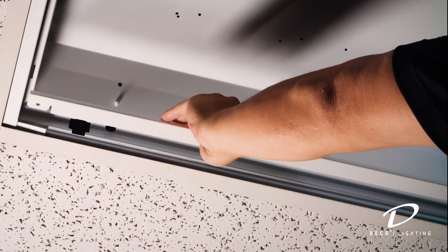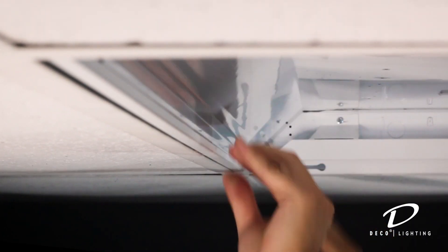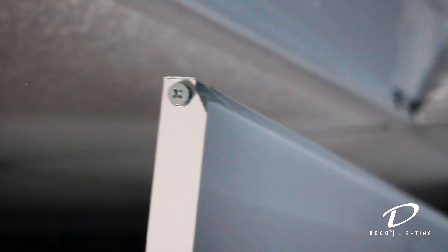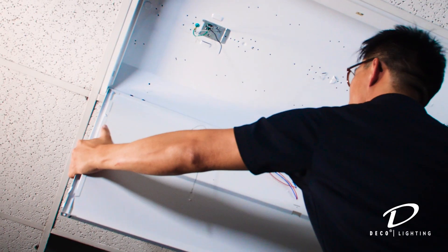Install the LED panel side brackets between the fixture and T-Grid ceiling. If you're uncomfortable with a gap between the fixture and T-Grid, there are two tabs that allow for placing the side brackets into the slot at the end of the brackets. Attach the door assembly body onto the keyholes in the end brackets, then slide it horizontally to the end of the slots.